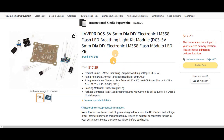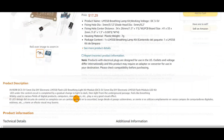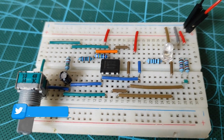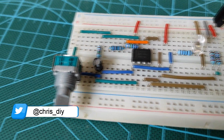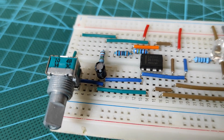Before moving to the project details, I want to tell you that the circuit we are about to produce exists on some web stores, but I don't really like the available circuit designs there, so I decided to make my own. Today's circuit is based on the LM358A operational amplifier configured as a multivibrator to produce a fade-in fade-out lighting control through its dual integrated amplifiers.